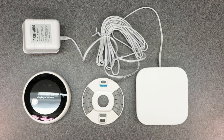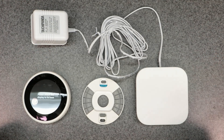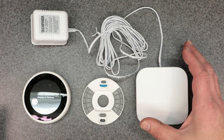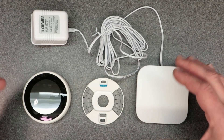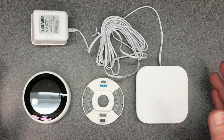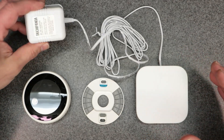Welcome to the channel. Today's video is covering a C wire adapter — an external C wire adapter you would use for smart thermostats to power them up if you don't have that extra C wire on the existing wiring in your wall. Say you have four wires coming out of your wall — you need a fifth wire, that C wire, the blue wire, common wire, to install a smart thermostat in order to enable Wi-Fi and all the extra functionality. It basically powers up the smart thermostat so it can function, otherwise you will not be able to run the smart thermostat at all, or only in very limited capacity.